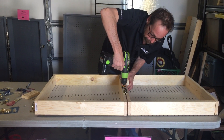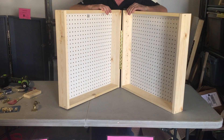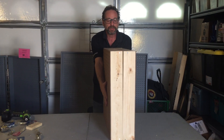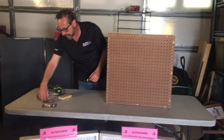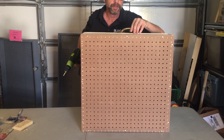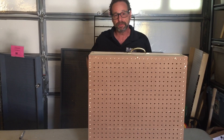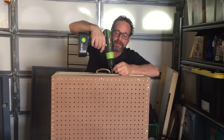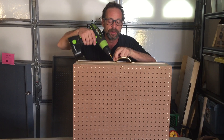There are six screw holes — I would put at least five screws in. I've only put a couple in because I want to show you how to get this done without it taking two hours. Now that you've put that hinge on, you've got most of your display. What's missing is a little bit of hardware. When you put the hardware on, place it where it's going to work and where it's going to fit. Drill a pilot hole for yourself, because if you do that you'll have no problems getting the screws where they're supposed to go. If you don't, the screws may not go where they're supposed to, you may split your wood, and your $20 investment may actually grow — all of which I can assure you has happened to me.